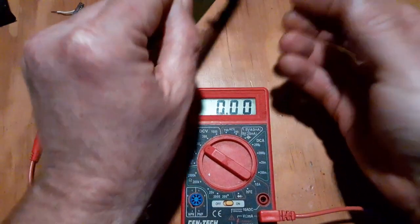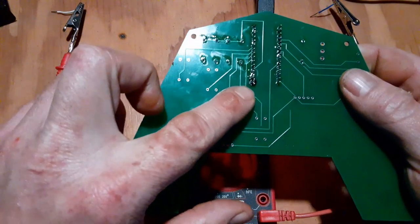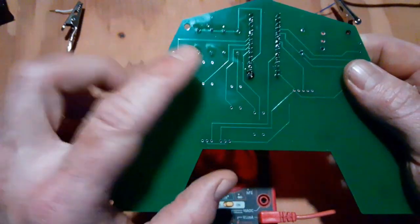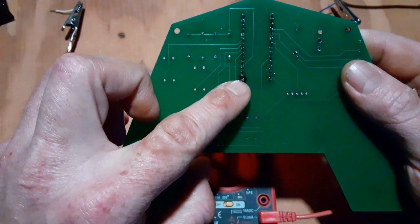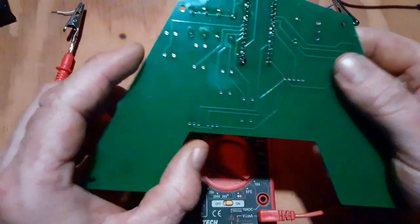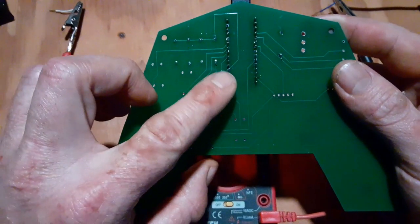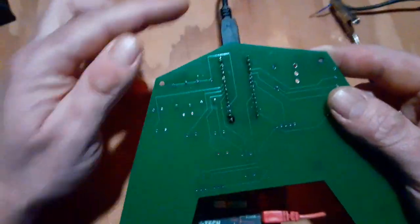So first thing, oh, and also where I got the scorch mark here, holding it there a little bit too long for the camera. I want to check that. It is on the transmit pin, the UART transmit pin, which I never use those first two because that's the UART communication, which is the same one. Whoops.